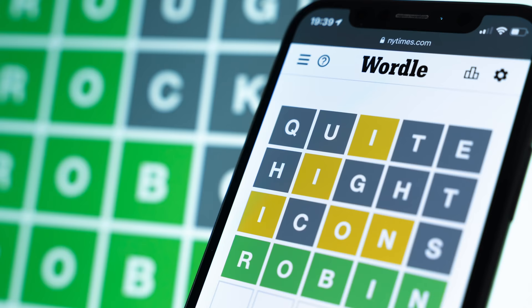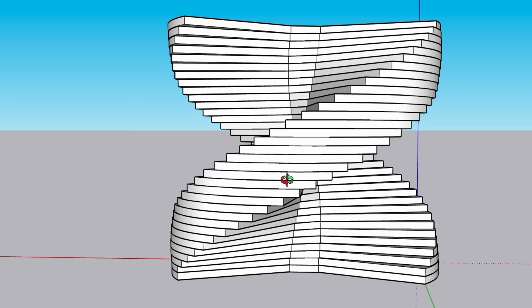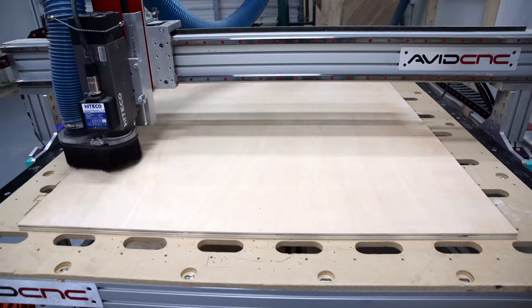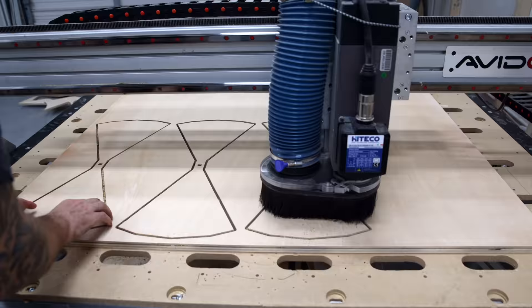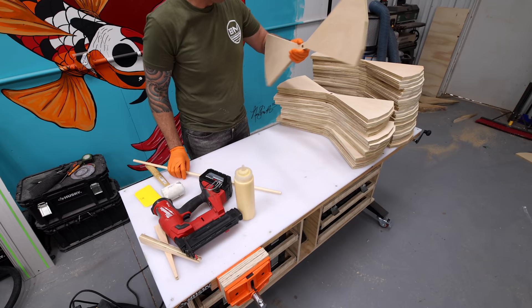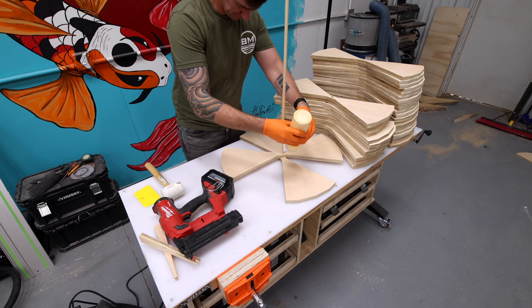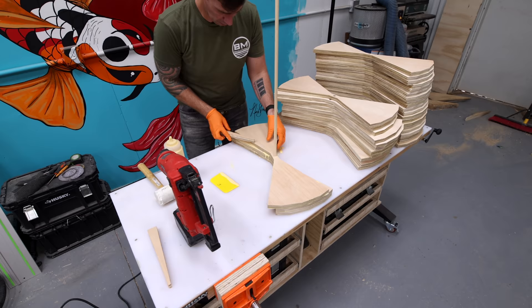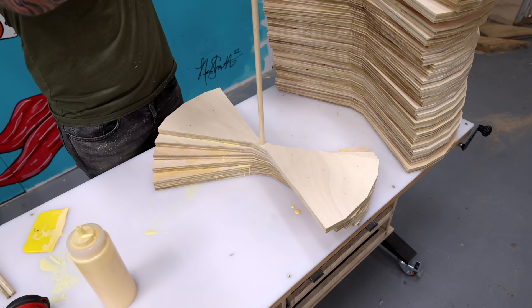It's kind of like playing Wordle — I've never guessed the word on the first try, maybe gotten it on the second try twice, but somewhere between guess three and guess five I usually figure it out. To create a double helix spiral, I drew up this bowtie-looking shape and then rotated each layer at its center by six degrees. I had to cut out 35 pieces total, plus two spacers to set that six-degree angle for each consecutive layer. Each piece has a half-inch hole in the center to place over a half-inch dowel to keep everything aligned. I used a ton of glue for each layer, set it to six degrees of rotation, and shot in brad nails to hold it while the glue dried — rinse and repeat 34 more times.